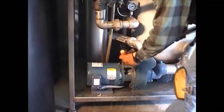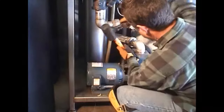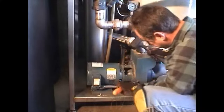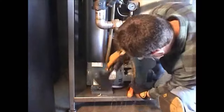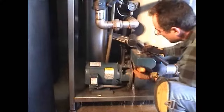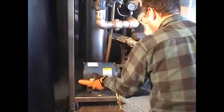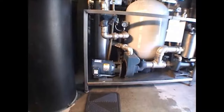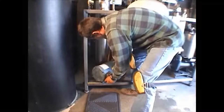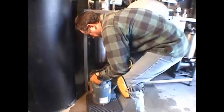When you remove the pump motor and adapter from the volute, do it gently but you'll also have to use some force. I like to use small pry bars and tap on them against the gasket material to wedge the motor and adapter away from the pump body. Gently move it back and forth, pulling it away from the volute, then set it on a safe dry surface — I like using a car mat so the pump won't get scratched.